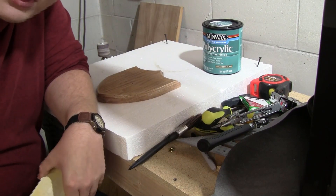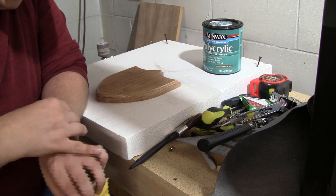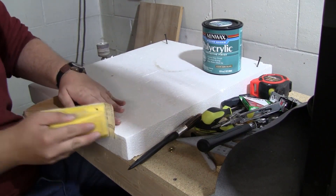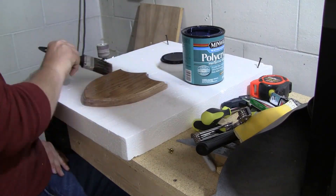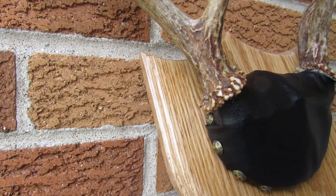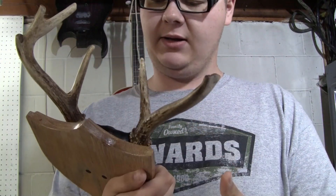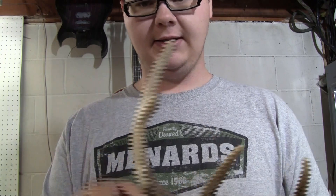So I'm just about to put the fourth layer of polycrylic on this. I'm going to sand it down with 320 real quick, get a smooth coat, and then put the fourth layer on it. I don't know if that's going to be the last one, but it's almost 11 o'clock. So if I'm still up later I'll put another coat, and then the fifth one will probably be the last one. I love the way this looks. It turned out a lot better than I expected. I was worried I'd get the angles all wrong, but it actually looks really good to the naked eye. I guess I'll see you guys in the next video. Peace out.